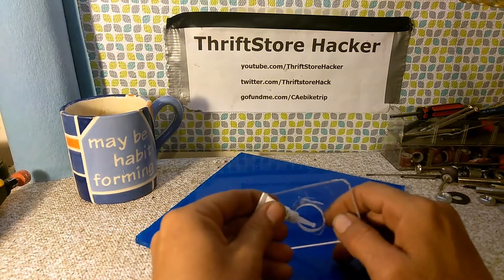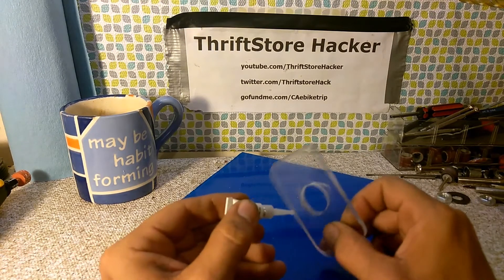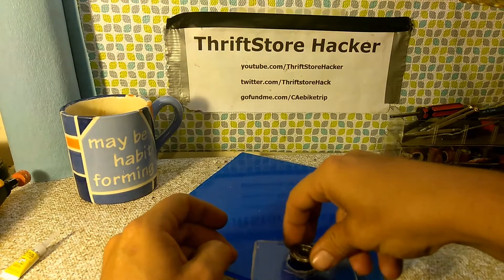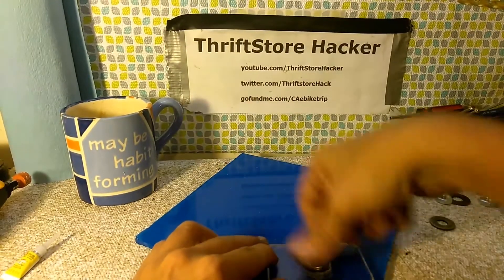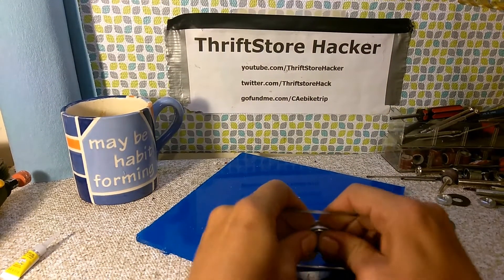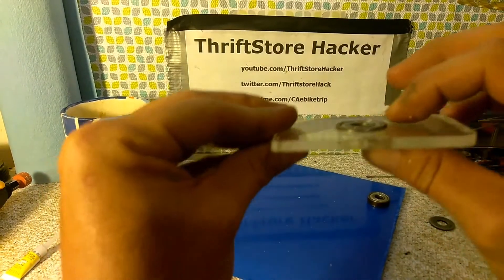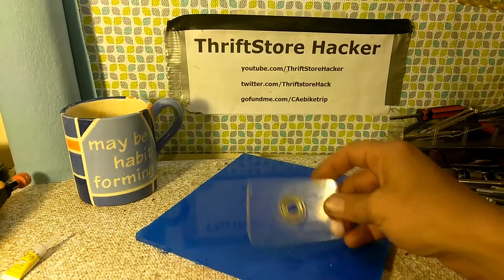Let's take a little bit of super glue and just put very little in there. You just want it to grab the hole and set up — you don't want it to leak down and get into the inside of the bearing. Put a little super glue in there and take our bearing, press that down in there. I'll push it through just a little bit more because the bearing is a little bit thicker than the acrylic. We'll just set that there and let that set up for a second.